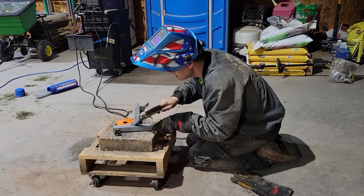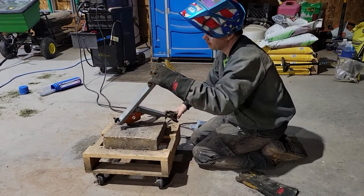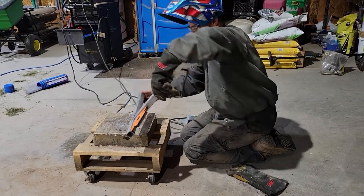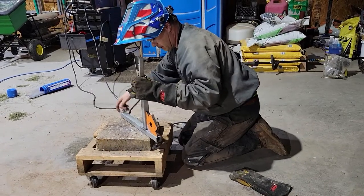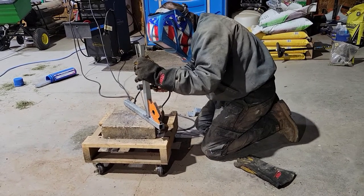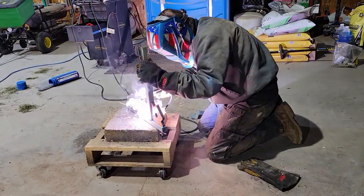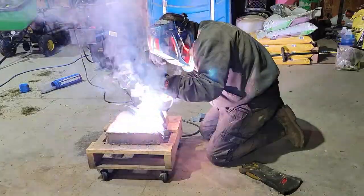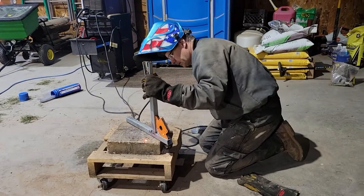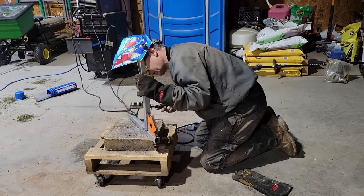I feel more comfortable with stick weld than MIG right now. I'm going to put it together with a nut welded to one end, making like a 12-inch tee out of it, then mount that tee to the plate, and mount that to one of my 4x4 big posts inside the arena. Then I can drop the headpiece in and adjust it where I weld the nut. I'm going to stick it closer to the ground to accommodate smaller goats, and the nut allows the headpiece to adjust up for larger goats, since I never know what size we're going to bring up to the scale.